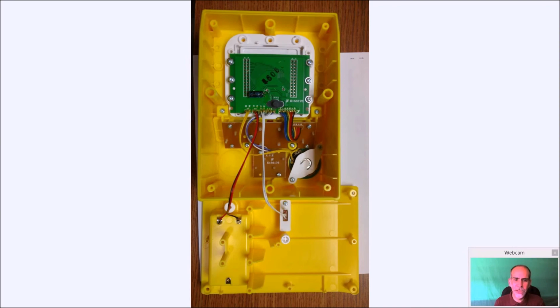So you can see inside here, the basic layout. This was the little tab here that put it to demo mode versus full mode. The reset button here, we're actually going to use this section as well. The battery compartment, so we have to unsolder these guys here. Take out this screw, remove this little guy right here. And then everything else is right here, and it's really easy to get inside and work on. Again, room is limited, but it's easy to work on this device.